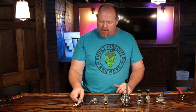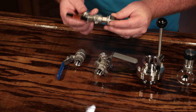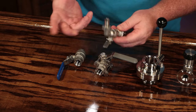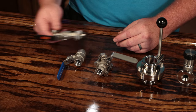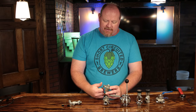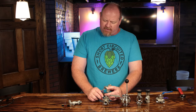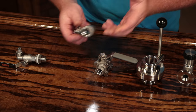As far as what the valves are good for: the basic spigot valve is a very decent, cheap option — really low cost. It'll work on fermenters as well as brewing systems. It doesn't have the highest flow, but as long as you keep it clean it'll provide many years of good service. Same with the two-piece ball valve — you're going to get better flow because of the size of the opening and the ball inside. They're pretty simple and pretty cheap, I think under $10. You get plenty of good use out of them as long as you keep them nice and clean.